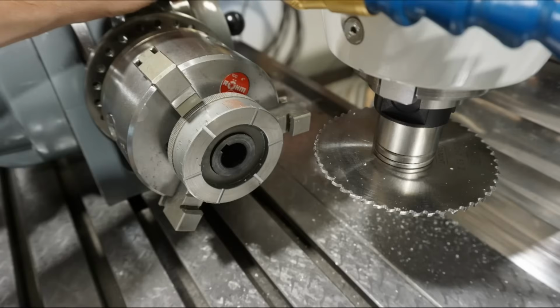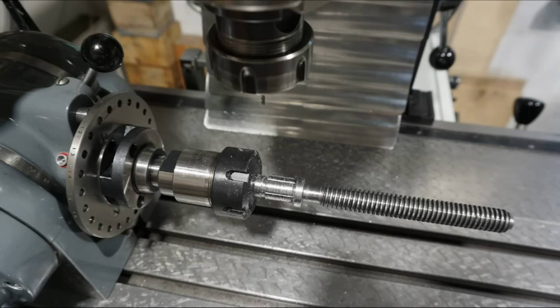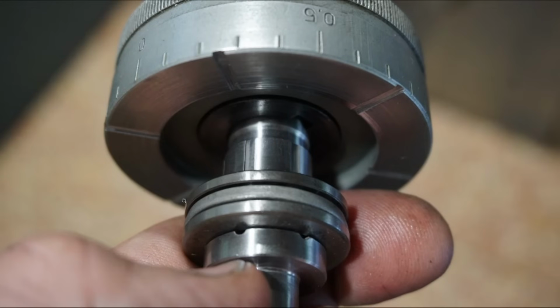Now the hand wheel and shaft part of the tailstock I modified a bit. You see these oil passages here. Also the shaft here received these passages. So here is the axial ball bearing that receives the thrust from the tailstock, and oil from the upper lubrication port hits that bearing, and then I wanted this oil to be able to drain to some place so that the inside behind the quill wouldn't fill up with oil over time.